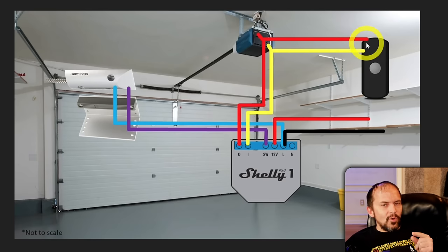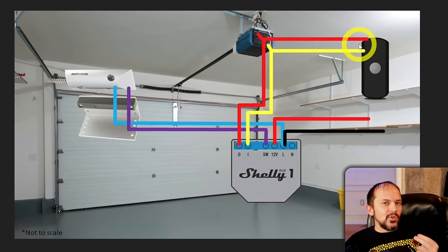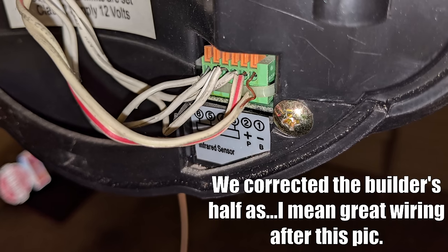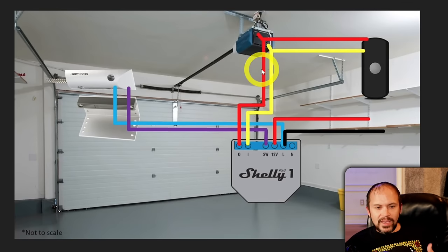There's a button on your wall for the garage door. If you have the digital type, you may need a different approach. I've seen some solutions where people solder directly to the buttons on the garage door opener remote — maybe not ideal, but some people get an extra garage door opener since they're fairly easy to come by, and solder up to those buttons the same way. We're going to be running wire from the Shelly One Plus up to the garage door, and I like to mount it on the garage door so you don't have to run it too far. You use those same wires in the exact same terminal slot — you're just pushing that button, like adding another wall button.